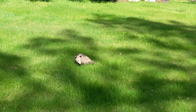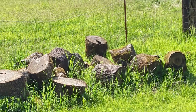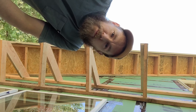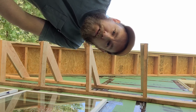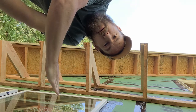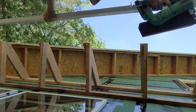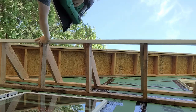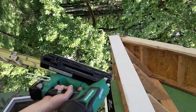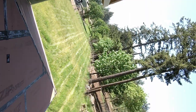I'm hanging up the fascia board on the mini roof on the uphill side of the house, and just one person — I'm running from the two outsides towards the middle. This is the second board and I'm going to go ahead and get this one butted up against the fascia on the walls on this side. I already did that side over there, and then we'll get that nailed off. It's going to hit pretty much where I want it on a joint, and then I'll just fill in the middle with the board. You can see we're just butting it up against the outside one, and I do have to take just a hair off that corner over there to get it to raise up on that side.